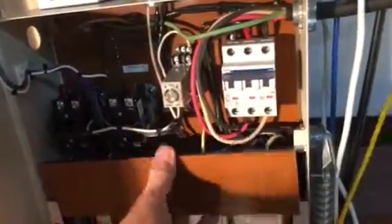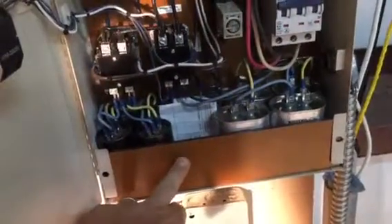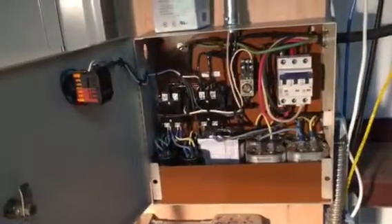Additionally, I don't have all these different buttons to push to get this thing operational. I just come over and hit one button. This is a phenolic block, 3 and 3/16 of an inch thick, and I've had to weld little tabs in here as a block to keep my capacitors in place. It allows the cabinet to shut nice and clean, and rather than hit multiple switches, I come over and hit one switch and it starts right up.